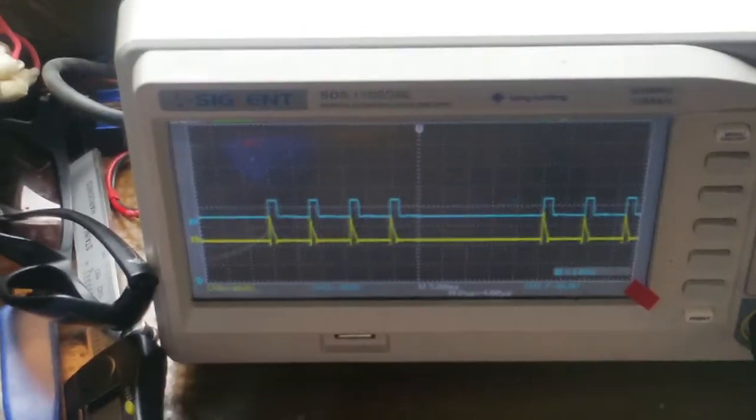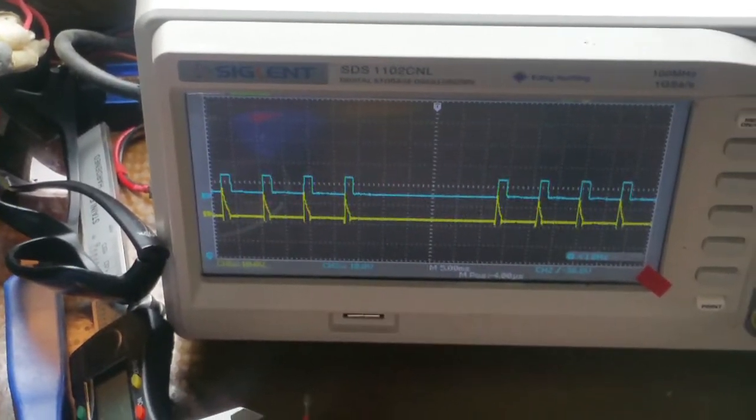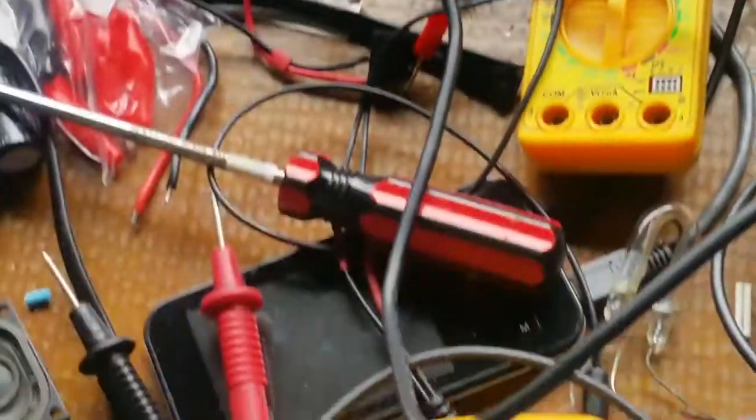And the other thing on the Lawton circuit is how close together those pips are. So if I dial that one up, I'll get closer together, and they'll fit more within the gate or the gap. So here we go, there's more fitting in the gap, and now I can change the gap to keep it at, like, say 4 pulses or 3 pulses. So Lawton circuit, finally got it working and doing what it's meant to.